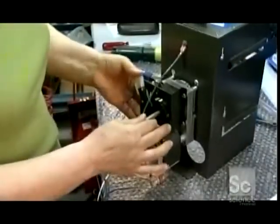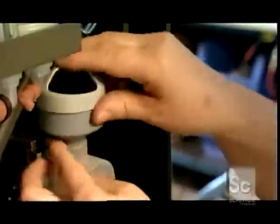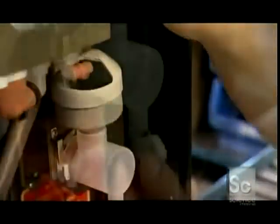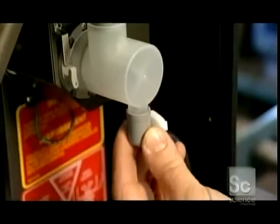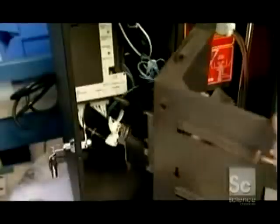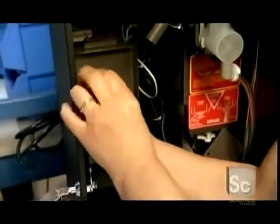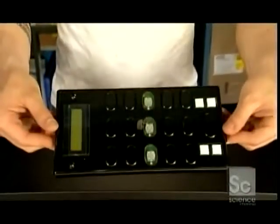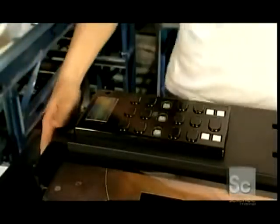The worker connects power wires to the brewer motor. Then she mounts what's called the whipper mixing bowl. This aligns with the chocolate syrup dispenser to prepare the hot chocolate. Next, she installs the brewer motor assembly into the machine's casing. This is the coffee machine's 15-button selection panel. It lets you select what type of hot drink to brew, in what cup size, and when to start. The panel also displays the prices when the coffee's not on the house.